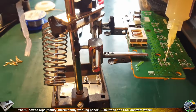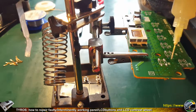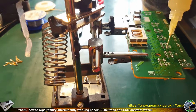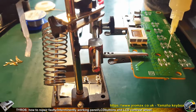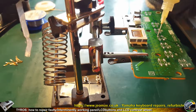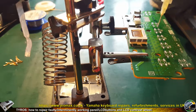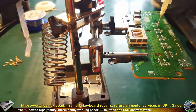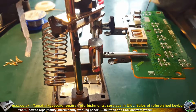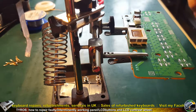Now the board is tidy and clean. I have cleaned it with isopropyl alcohol, almost 100% pure, to make sure there is no residue left. As you can see, now I'm putting the flux back on the solder parts just to make sure everything will be easy. As you might know, inside of the solder there is a very small amount of flux which helps you complete the soldering process, but more flux is even better, because it prevents you from making mistakes, like for example bad joints, cold joints, or joints of bad quality. So I encourage you to use flux in all soldering and desoldering jobs.